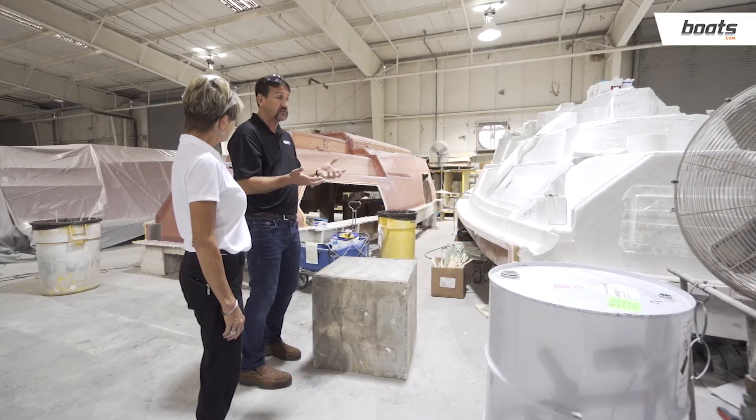When we used to wet this out by hand with a paint roller, any excess resin you put on there stays there and has no place to go, so the part is heavier. When you pull a thousand-pound part from a hand layup and you do it as an infused part, it's probably 100 pounds less — a big difference. When you do that over several large parts, now you're talking about a real performance difference because of the weight savings.